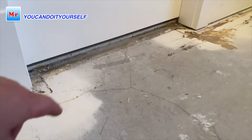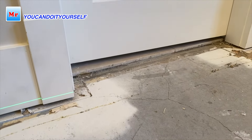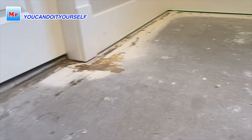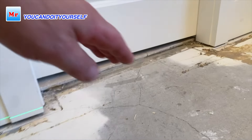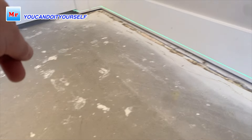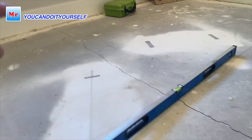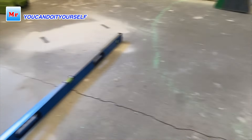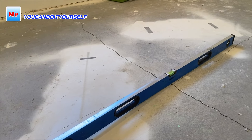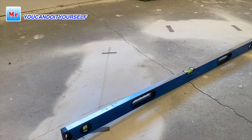What I have to do here is make the floor flat with the tile in the bathroom, and also join the floor to the existing floor. The tile is higher than the subfloor — if I make it flat, the hardwood is approximately 3/8 inch higher. So I have to add self-leveling compound on this side. Close to the closet there is a very low spot — I need to add approximately half an inch of floor there.